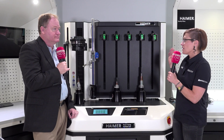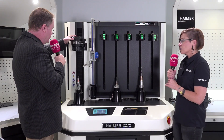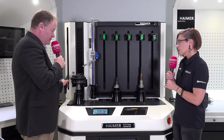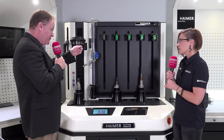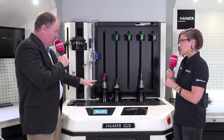Can you walk us through step by step how this machine works? I would come down, here's my unique ID, and I have this little scanner here. I scan this unique ID code and it tells me exactly where to position the coil — in this case, position number three. This is our inductive coil. We also have an automatic coil which could do that for you automatically. Then I press and hold this button and that's going to heat up the tool. Now you'll hear a sound — that's the heating cycle — and the cooler just kicked in. I can take my old tool out, put my new tool in, and the blinking light indicates the correct cooling body for this particular tool holder.